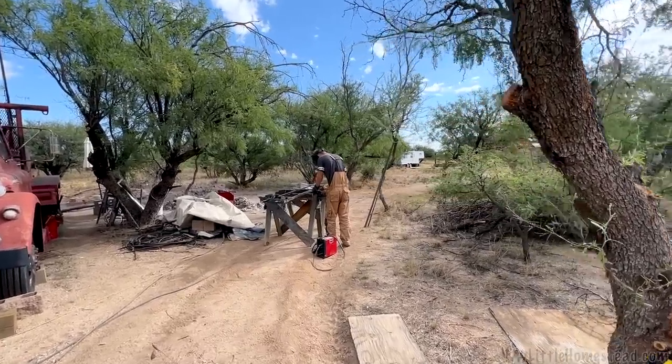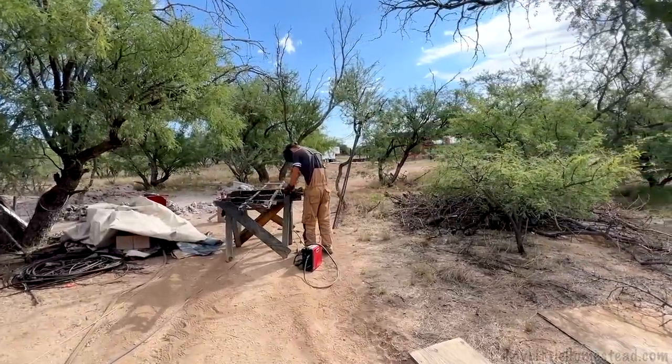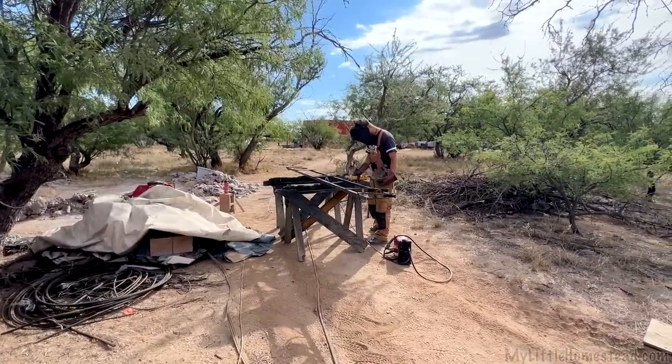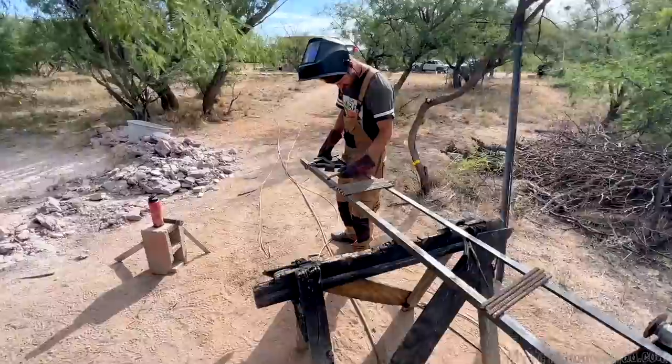So the other side lines up perfectly. But this side, the trusses go right next to the building. We decided to just run trusses right across the block wall that stick out and meet our main truss that goes across. Because it transfers all the forces straight down instead of the forces going sideways.